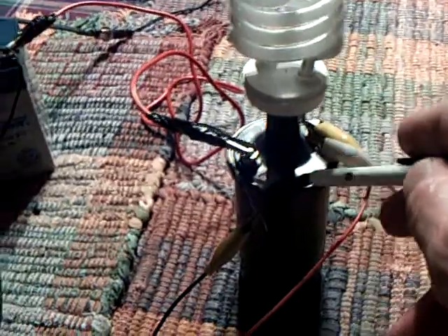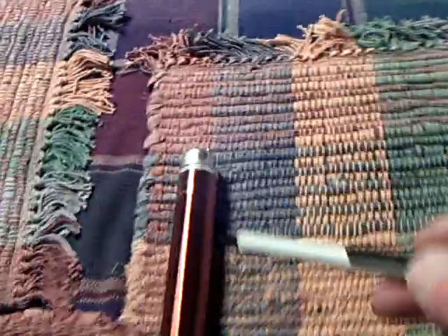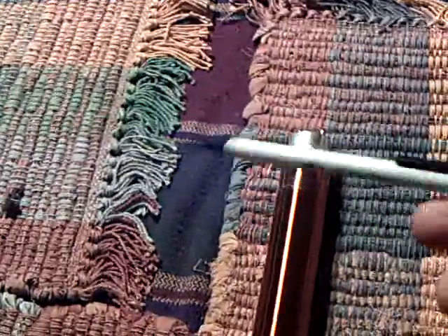What I have here is a CFL mounted right on top of the ignition coil, and then I have this conversion tube, another ignition coil with a receiver ball, and a 110-volt neon to show the energy coming into this side of the circuit. The conversion tube is hooked with one wire into this long tube here, which is Aroma's idea. It's a fluorescent tube, about an 18-watt, wrapped with 26-gauge wire. Mine is 700 turns. One end is open down here — nothing on that end, and there are no wires on the other end of the fluorescent tube at all.